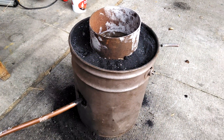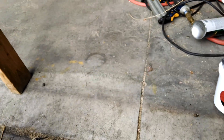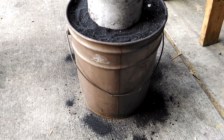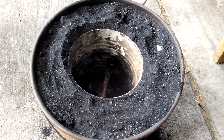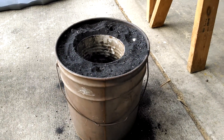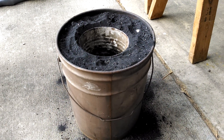Okay, so here is the furnace. I have the pipe coming out here. I used some cement and mortar to clog the hole in the side and touched it up with some sand so that it wouldn't leak. This is just a ring to raise my height. I have the coffee can here and it's lined with cement. It's kind of hard to see but it's buried there, because my previous furnaces gave out when the coffee can basically disintegrated and broke down over having repeat fires.